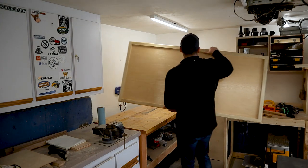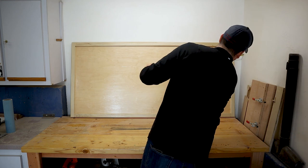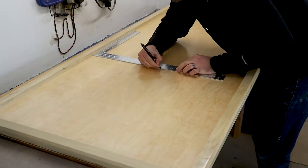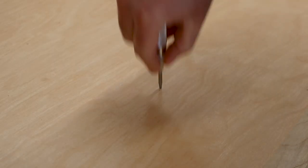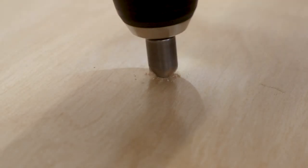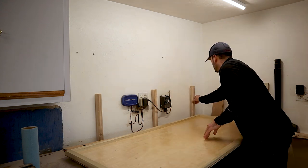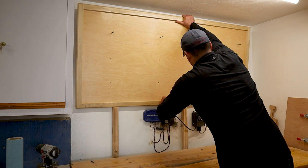Next it was time to lift this panel up and screw it into the wall. I first measured the entire wall opening so I could align it to the center. Once I had it in place, I transferred lines to the tool wall to mark out the stud locations. I ended up putting a total of 12 screws into it — a bit overkill, but it's not going anywhere. Make sure to pre-drill and countersink so nothing splits and your screws don't extend past the plywood face. Off camera I cut out some spacers to help hold up the wall while I got everything aligned, leveled, and attached.